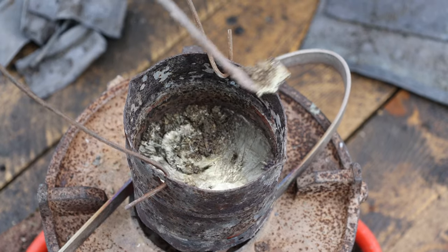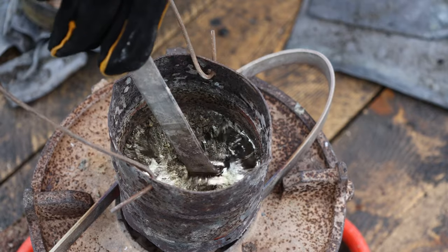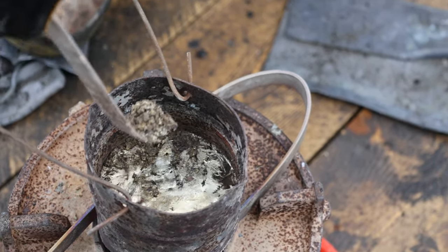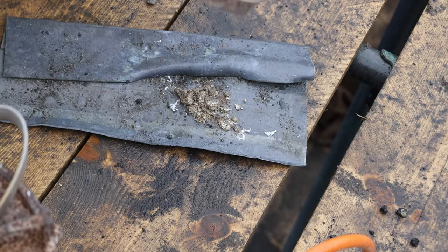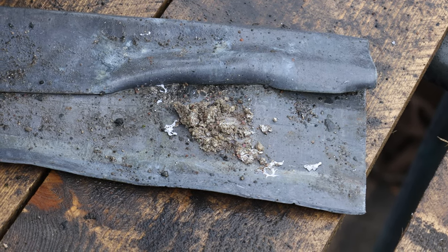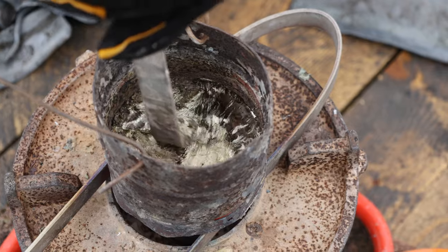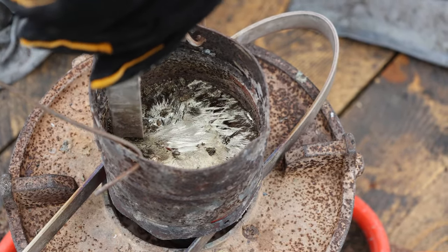Well, you can see you just get this excess of material on the top of it, which is just basically from when we've had lead in it, because we generally just use old lead on site, old flashings and soakers that we pull off site when we've replaced them. So we just melt that down and use that for bedding these cramps in.